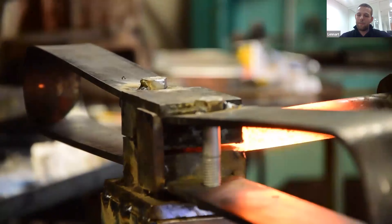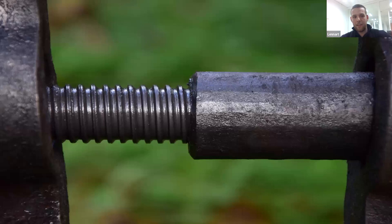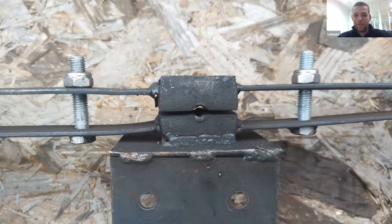You need to continually feed it inside the swage. When you want to come back out, you can't just pull it - the swage is only opening about three millimeters, so you need to thread the screw you've made out of this split nut. If you do this for one, two, or three heats, you will get a threaded bar like this one - just out of the swage. While working, make sure you don't have any scale on your bar or accumulating inside your swage, so I used compressed air to blow it out and graphite paste to lubricate the inside.